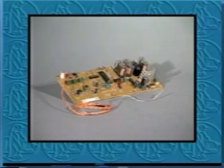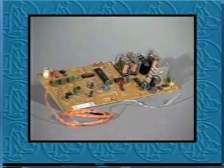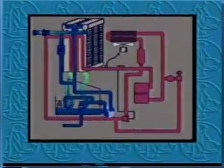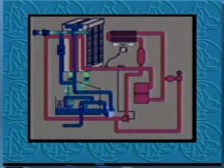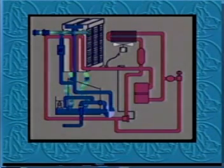When the thermistor senses that the evaporator temperature has reached 48 degrees, the solid-state defrost completion timer on the circuit board takes control of the remainder of the harvest cycle. During the harvest cycle, the inlet water valve brings water through the supply tube and down the center of the evaporator plates. This water flow also helps transfer heat from the serpentine coils to the stainless steel plates and pre-chills the water flowing into the reservoir.